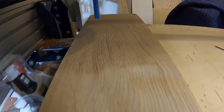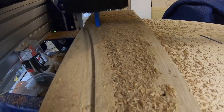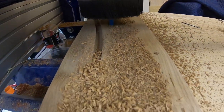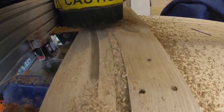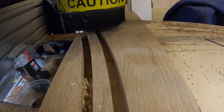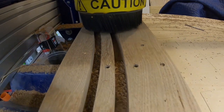I had to cut three sections of the curved material out of this, as you can see. What I did was drill dowel holes in them so I can stack them on top of each other and glue them without them slipping around. Sometimes it becomes very difficult when you're trying to keep a form together and I didn't want to use brads or pin nails because I knew I was going to have to cut it later. So for the top and bottom forms I drilled a blind hole, but for the center form I drilled all the way through so a dowel would go all the way through and connect all three pieces together.